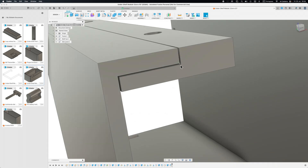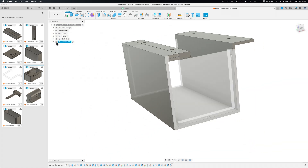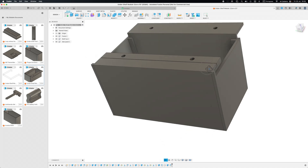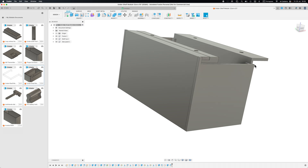There's a bit more height here to give it some rigidity and it all fits nicely. There is some leeway because you want this to slide in — not too loose, but not so tight you can't slide the modules in. Then there are the side panels: I designed one and then flipped it, giving one on each side. I actually realized after finishing this that I didn't need the bottom piece, since the clamp doesn't go all the way across anymore. But I decided to leave it because in some cases these modules are connected together — like the workshop amplifier connected to the dummy load switcher — and it's convenient to pass wires over the top.